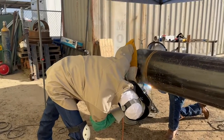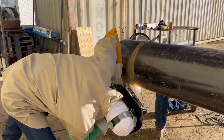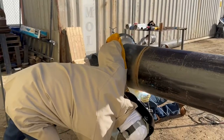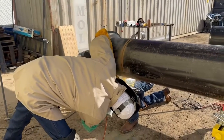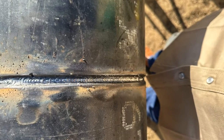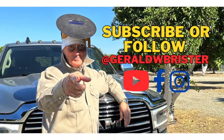So we'll just watch this being finished out, and then we'll have a picture of what the hot pass looks like. I should have cleaned the BBs off of it, but you'll get the point. It looks like little arrows, little Vs when you're running out heat. As your heat comes up, the shape of the puddle has that V-shape to it instead of the crescent. So we'll see you next time.